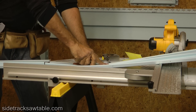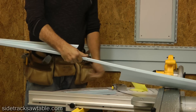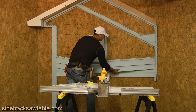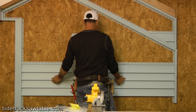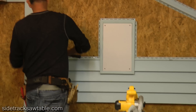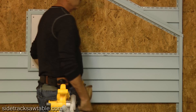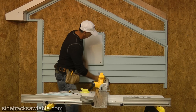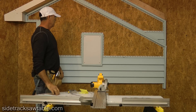You can use snips, but if you've got a straight shot, just use a knife. And that's your piece. You'll notice you've got about a quarter inch gap. You can open it — everybody knows you don't nail it tight. But you do need a nail below this edge here. If the nails stick out too far, they will show through on your siding and probably leave marks.